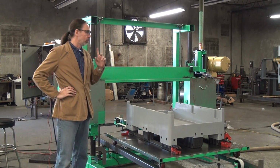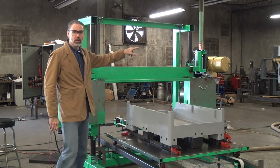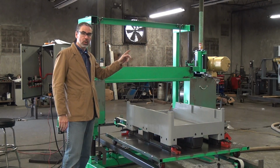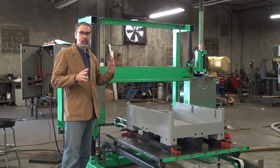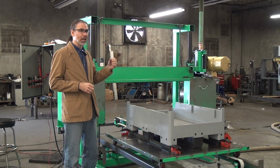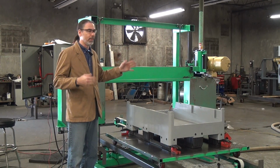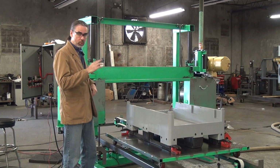This machine uses our variable speed control panel, so the blade drive motor, big gold thing over there, is a 5 horsepower 3-phase brake motor, inverter duty. We have it set up to run with a brake, which requires a little magic. Basically what we do is we have the brake disengage anytime the motor's running at any speed and then re-engage, so you have nice positive blade stop. When you hit the stop button, the blade stops now instead of spooling down. It's controlled with an inverter.